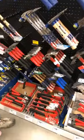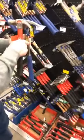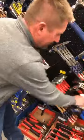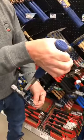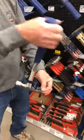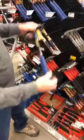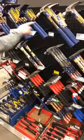Your other style of hammer is more of a framing style, and you can see the big difference - it's flatter. The reason they're flatter is because we're working in tighter areas. If we were all the way back here pulling, we might be hitting a stud or a board that's in the way. So we have less leverage for pulling, but you also get a longer handle. That's more of a framing hammer.